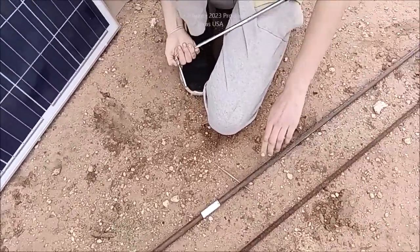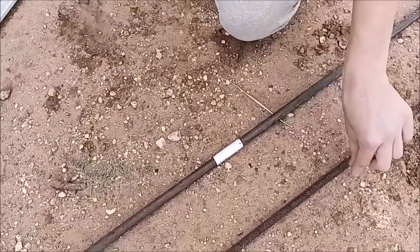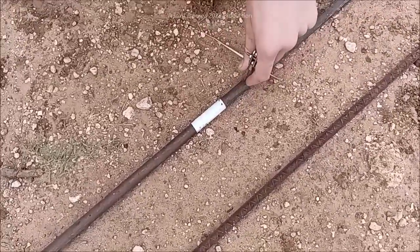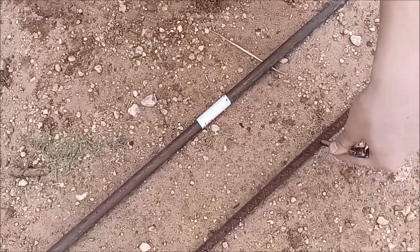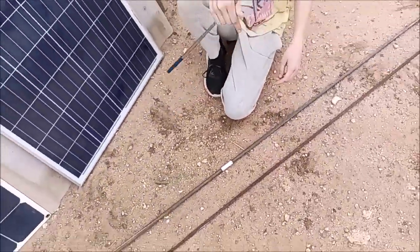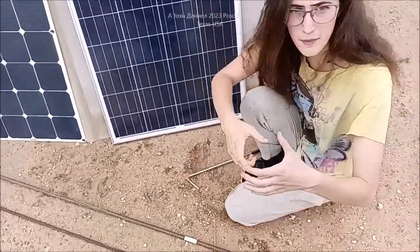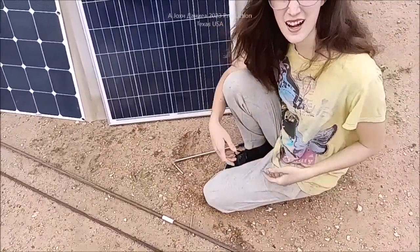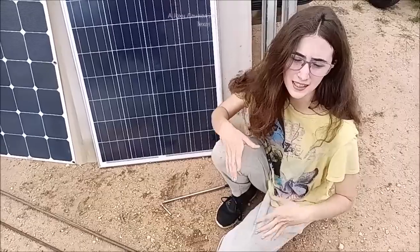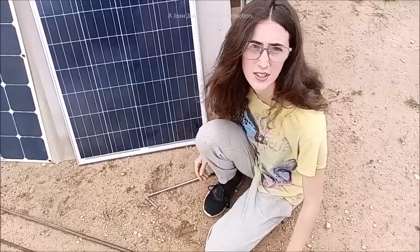What we have right here is what is usually used as a ground, which is copper-coated steel. And then this one's just steel — they're both magnetic. But this one is actually a better one to use for your ground. When you put a nail in the physical ground, it creates an imprint of iron around the nail. When you take it out of the ground, the iron stays. That makes it better because it can dissipate out into the ground a lot more effectively. With the copper-clad rod, it just doesn't do that.